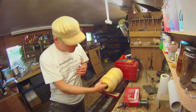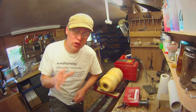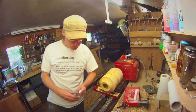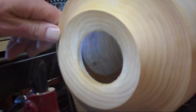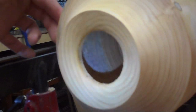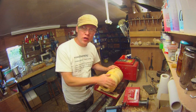I've finished the hollowing. I've got the walls down to about 15mm — just under or just over half an inch — so not exactly the world's thinnest walls, but that's not what I'm after. I'm just after a hollow form that I can shape a little bit more and then sand down and be happy with. Let's have a look inside — we've got a fairly smooth inside of the piece, I'm quite happy with it. Because I can't reach down there with my fingers I'm not going to worry too much about that, but it'll do.